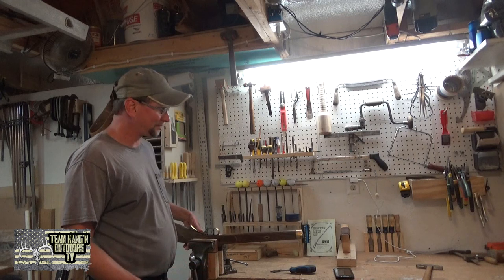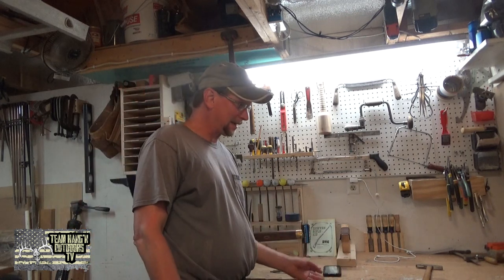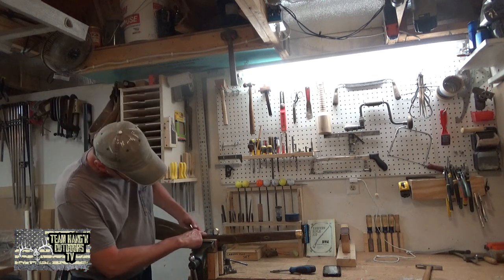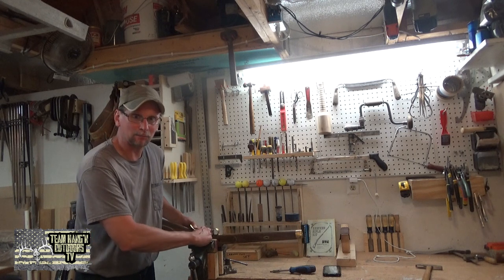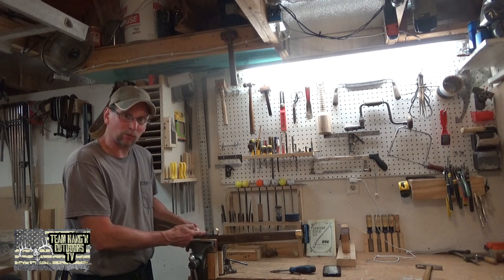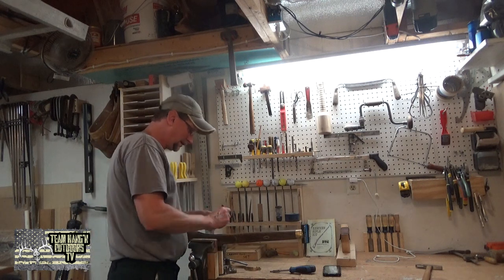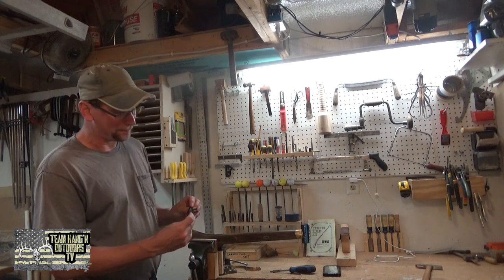Okay, here's the update. I just chatted with somebody on Facebook Messenger who's a gun builder, because I was sitting there scratching my head, not sure what to do. He said to adjust the back of the trigger, the heel, and make it more circular in order to have room to pull back. Right now when I pull back, the trigger is hitting the guard, which is not good. So I have to take it apart, which I've never done before.